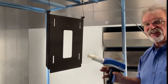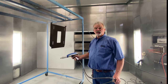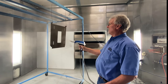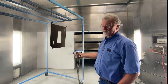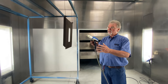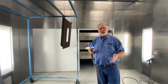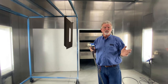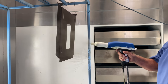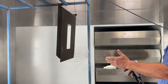Notice again hand speed — not fast. I can't tell you how many times I've been out in the field watching experienced powder coaters, or at least they claim to be experienced, doing this. You see all the powder flying around? That's because it's not getting charged and getting to the part. Because we believe the powder coating process is holistic — not only do you have to have a good gun and good charging technology and good ground, but you need to have a good booth. A good booth can add to your transfer efficiency by not pulling powder away from the part as you're spraying. With a good gun, all that powder is going to the part, not getting sucked to the filters.